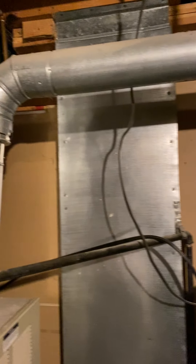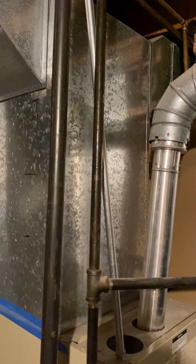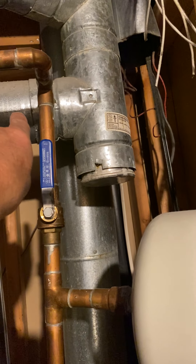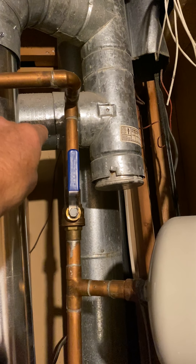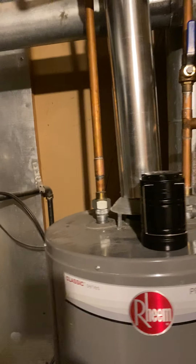For the vent, we're gonna add a two-inch flat termination and two-inch PVC going out the back. I'm gonna cap the furnace vent — the B vent. If you feel ambiguous about it, you can take off this T and cap it there. Either one.